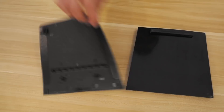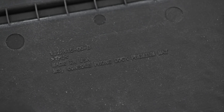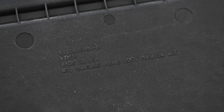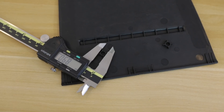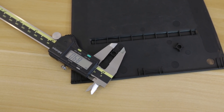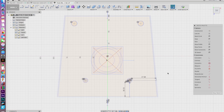We designed the charging pad to precisely match Tesla's original mat. On the back it says the mat is made of TPU material, which is the same material we're going to use for 3D printing. We used digital calipers to take precise measurements of the posts and registration keys, then sketched out the dimensions using Autodesk Fusion 360.